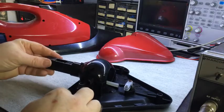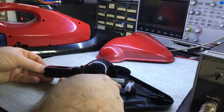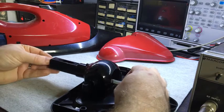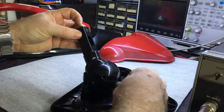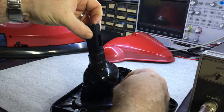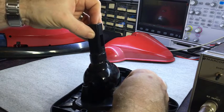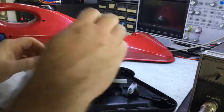I've just partially assembled this — it just drops together to show the hose length. The hose normally goes on this end here. If I hold it about halfway along and lift this up vertical you can see the hose sticking out at the top. When it goes almost vertical, which is where it normally sits, the hose is actually too short — about a centimeter too short — which is why it broke in the first place. You could blame it on bad manufacturing.